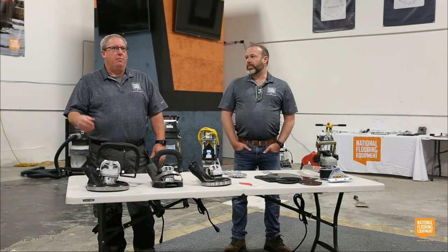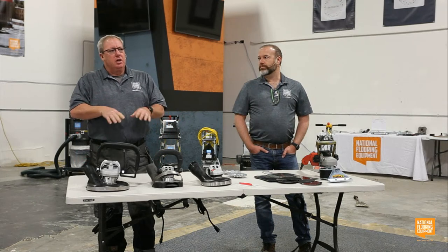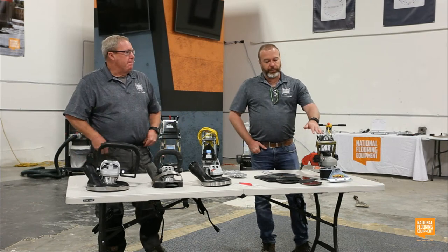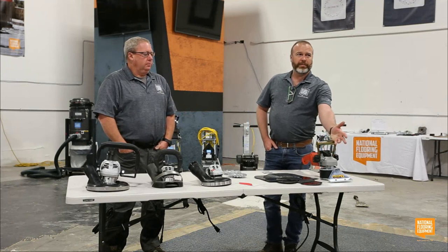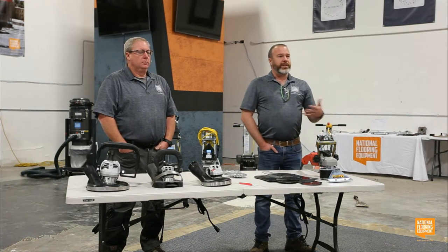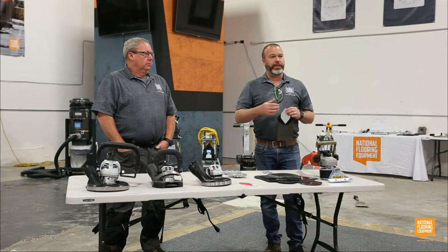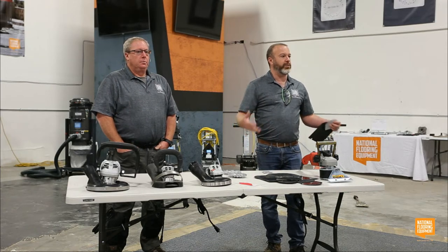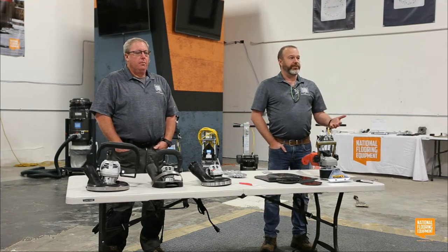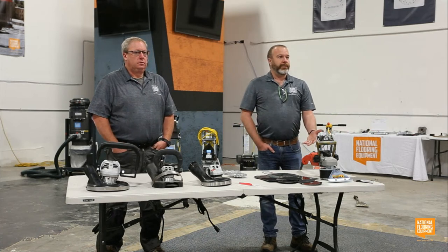Guys that are having problems with floors failing from the corners out definitely want to use these tools to get in and prep those corners. So when they put down whatever kind of coating they're using, it's going to adhere. Well, I think a tool like this one is a selling point. That's something you have to market. Hey, your other garage guy, they're going to use this type of tool to get into the corner to prep. I actually use a tool that has the exact same tooling on it as the rest of the tools I'm using as my actual grinders. So I'm going to actually get in there and prep those corners, so you're not going to see them fail. And the likelihood of it failing with this other method is significantly greater. So use that to your advantage. You paid for the tool. You've got to market it.